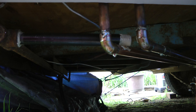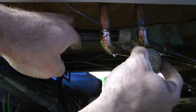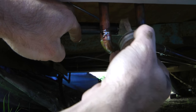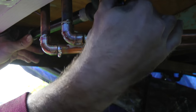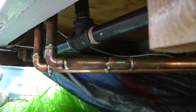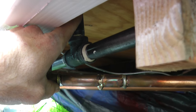I'm making up these connections using joint compound. Here's how it looks so far: I have gas coming up through the floor right here to service the refrigerator and water heater, and I'm about to fabricate a piece of copper tubing that will travel from right here through the floor to the furnace.